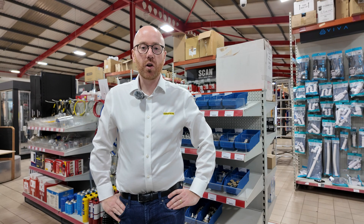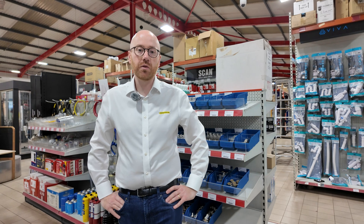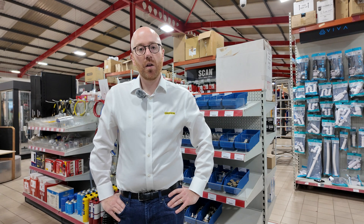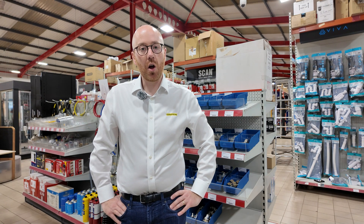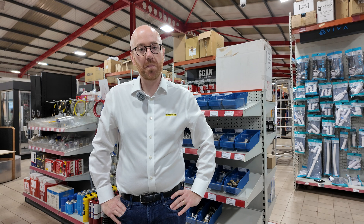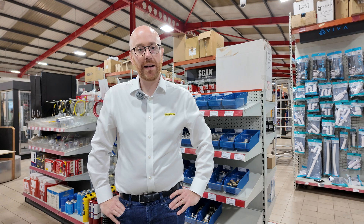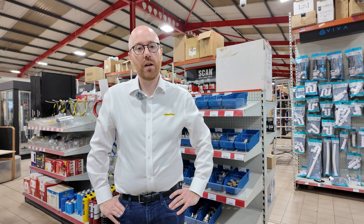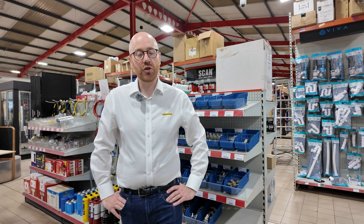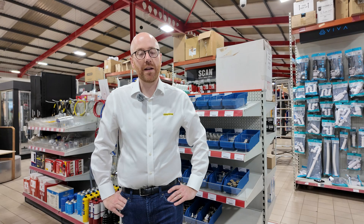Copper is often considered the gold standard in plumbing and heating applications; however, there are many drawbacks. Firstly, it is susceptible to corrosion and prone to incrustation build-up such as limescale and magnetite. The price of copper is obviously a huge factor, and not only is it expensive, it is very volatile, making it difficult to price jobs in the future. Copper is also quite damaging to the environment — the mining, processing and refining of copper ore has a huge environmental impact. MLCP, on the other hand, has a much smaller environmental impact, and Frankishire will be launching an EPD — an environmental product declaration — on the product by the end of the year.